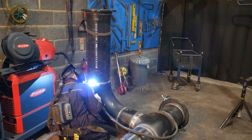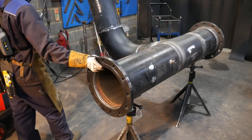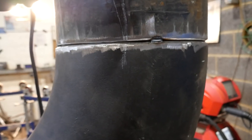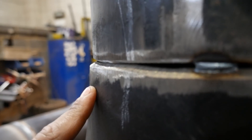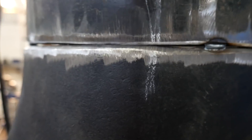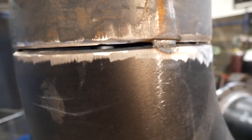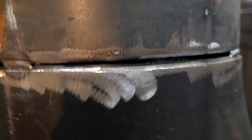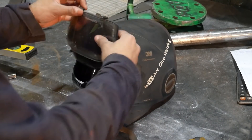Four tacks around an inch long should be enough to hold it together. When you're doing your root run you can weld quarters to each other. This is going to be a challenge — small gaps, big gaps, pipe alignment. The fittings are never properly aligned to the pipe; there's always some offset. I've got a lip at the bottom, no gap — the root will never come out perfect with so many inconsistencies in the prep. The best I can do is full penetration the whole way around. But before I attempt that, I want to change my screens so I have a fighting chance.